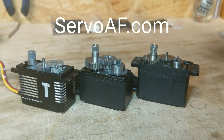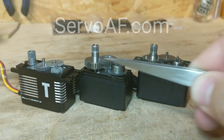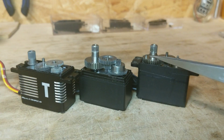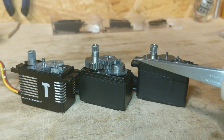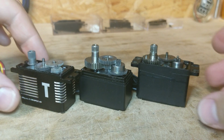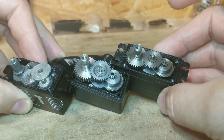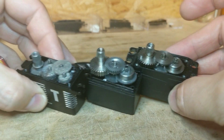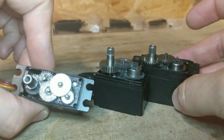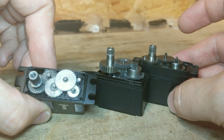This video shows the difference in gear trains between the Model T and the other common gear trains found in your $100 to $140 servos. Right off the top, you can see that your two common servos have a 4-reduction gear train and the Model T has a 5-reduction train, with every gear riding on its own dowel pin.